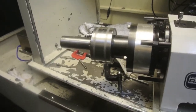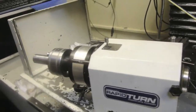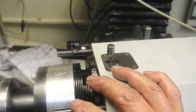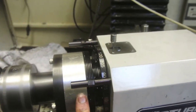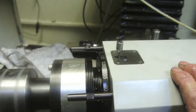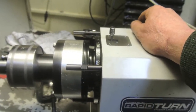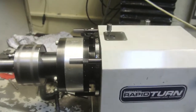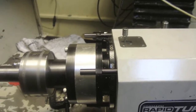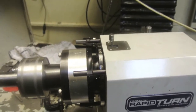I'm going to put it all together and try it and see if I can get it to grip metal. I'll film it when I get it sorted because I think it's a worthwhile attachment for the rapid turn. Also, people complain you can't get the torque with the rapid turn — well maybe you can, because I've managed to drill and tap this. There's nothing to stop me making a slightly larger pulley that goes over the outside of this one to increase the torque available at the spindle. I think it could do with a little bit more for larger diameter work. It would give you the certainty that it's not going to stall on a heavy cut — but that's another job I might tackle.